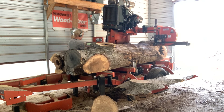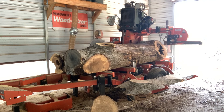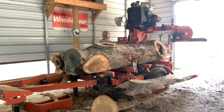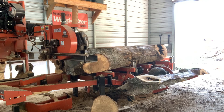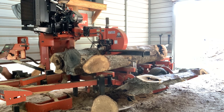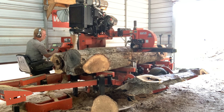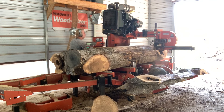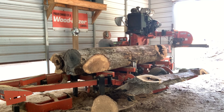I was looking back to make sure my dust collection system was on — getting a lot of fine sawdust blowing back at me there. The dust collection system worked real good. You have those issues when bark or little pieces of limbs clog up the exit point on the sawmill, so you have to keep an eye on that. When it gets clogged up you get a lot of blow-by. But other than that, this dust collection system worked really well and kept it all pushed back outside. I have several customers that come pick up a good bit of it from time to time.